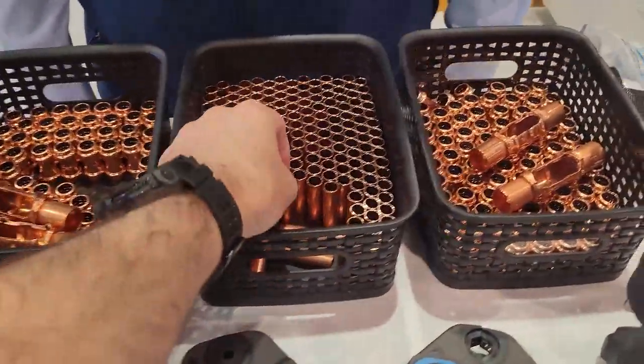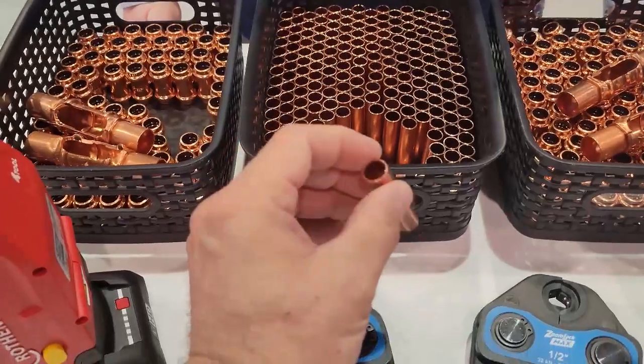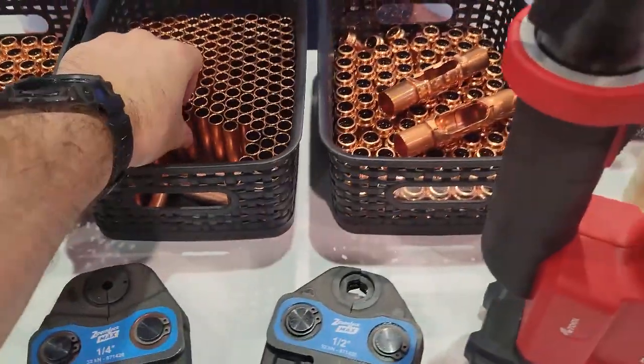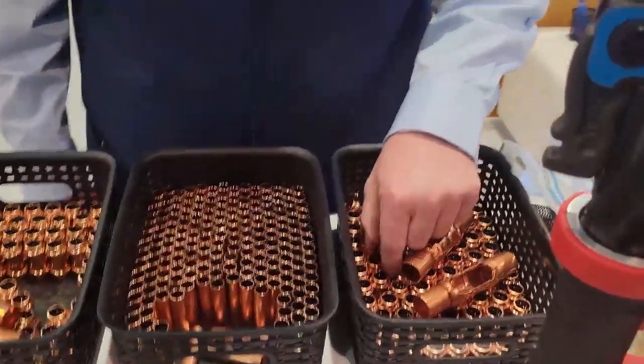It's how you prep the pipe. One of the most important things when it comes to prepping the pipe is actually deburring the outside of the pipe. A lot of people — proper practices tell us to deburr the inside because we don't want those metal shavings ending up in our TEV or something like that. But the prep of the outside — correct me if I'm wrong — it's because you can tear the O-rings.